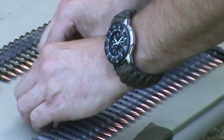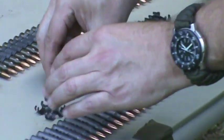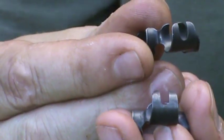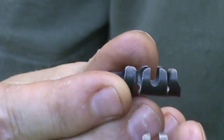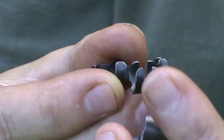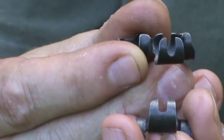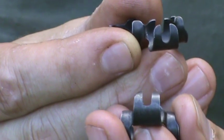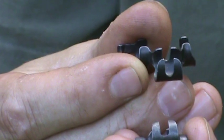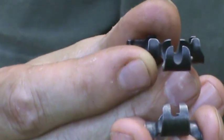Here are some of the links. One thing that differentiates these from any others is the slot. You will notice a slot in the links. Here are two links for the Valkyrie system — you'll notice this little slot that's cut in the end of each one. As we explained previously, that is so the slot can engage a tooth, so when the bolt carrier pushes the round through, it doesn't twist the belt. That's why the slot is necessary. These are made custom for the Valkyrie gun.